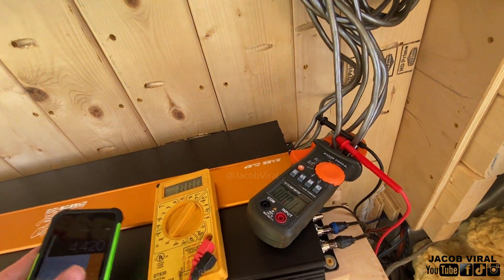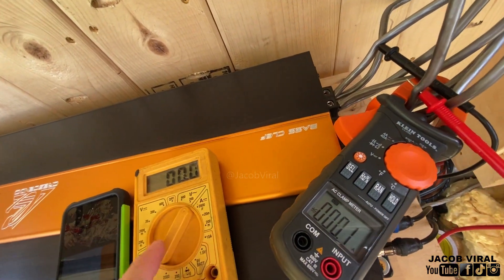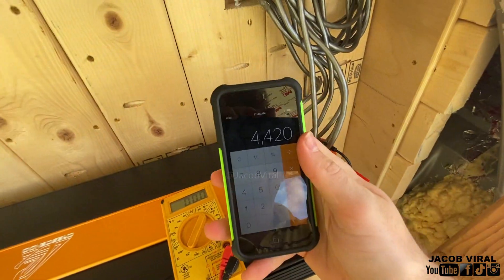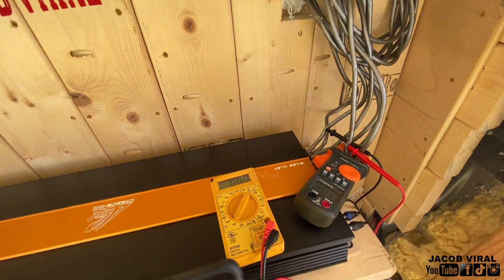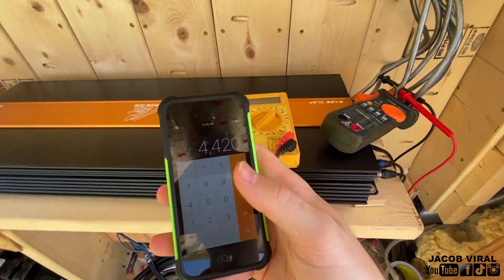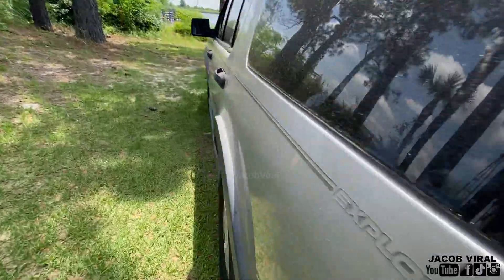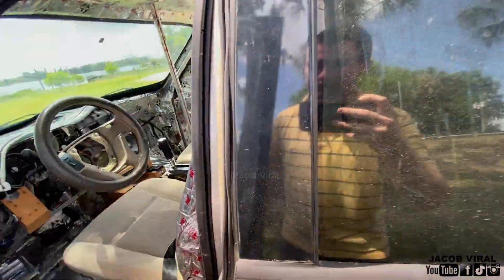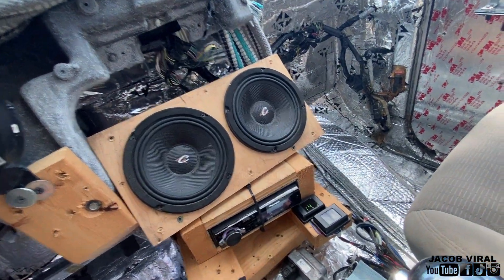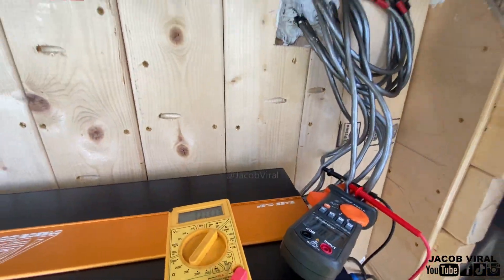So 66 and 68, or 64 and 68 — it was around there. That was the amperage and that was the actual volts. So let me do one more run. That's around where I'm clamping — about 4,400 watts. This amp is rated at 6K, and I think that's what I'm clamping there, and this is not clipping. So I'm going to go turn it up one or two more notches just to show you how much of a difference it is by turning it up a little bit — just so I can show you all the difference in results, just by it clipping.